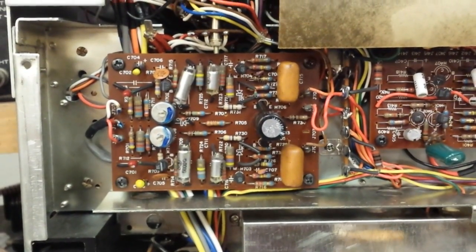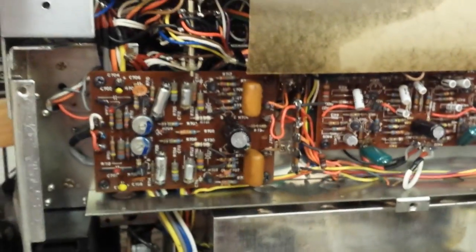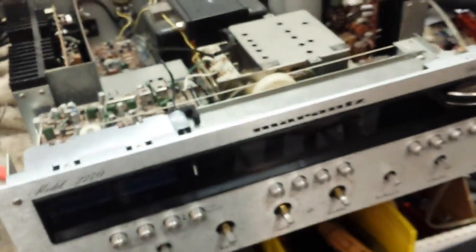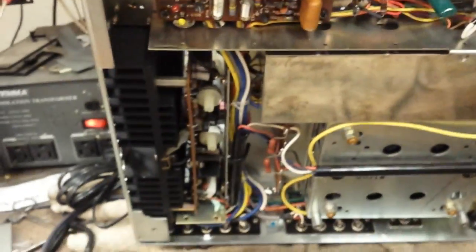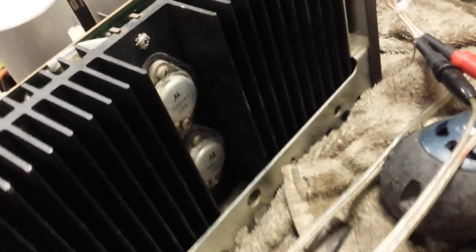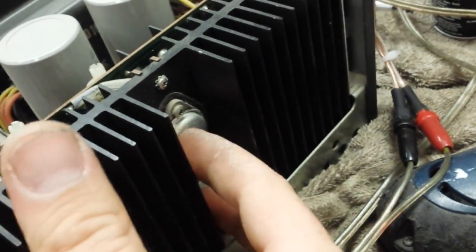There are normally 2SC 458's. If they're 2SC 458's, get them out of there — they're leaky, they're noisy, they're bad. You can replace them with a 2SC 1775, 2SC 2240, or 2SC 2547 — low noise, mid gain transistors with about 200 gain. As far as doing the setup adjustments: get a voltmeter on your millivolt meter range with the speakers disconnected. The outer pot here is your DC offset adjustment — there's one here and the opposite one is on the bottom. Adjust it for 0 volts after it's been on about 10 minutes, and then once it's had a chance to warm up, adjust your bias per your service manual. I think it's about 14 millivolts across the emitter resistors. On some of these the collectors are in the output circuit, so you can do a plus and minus on the collector and get that millivolt reading there.